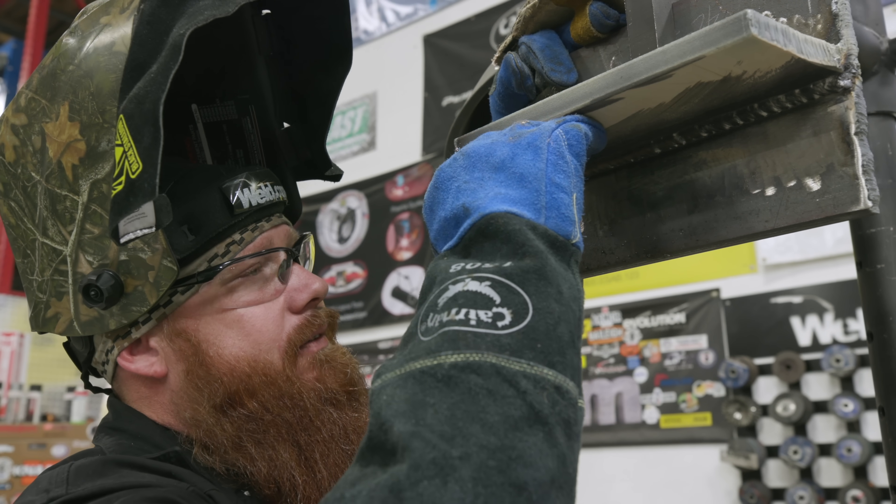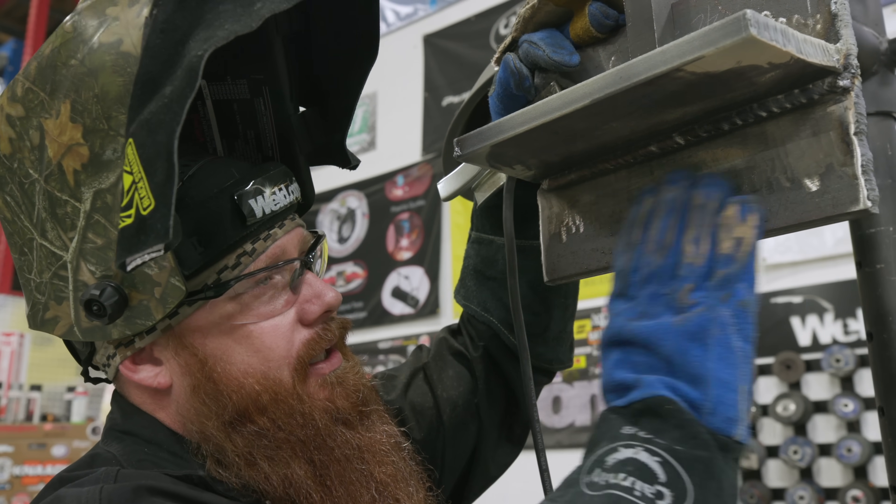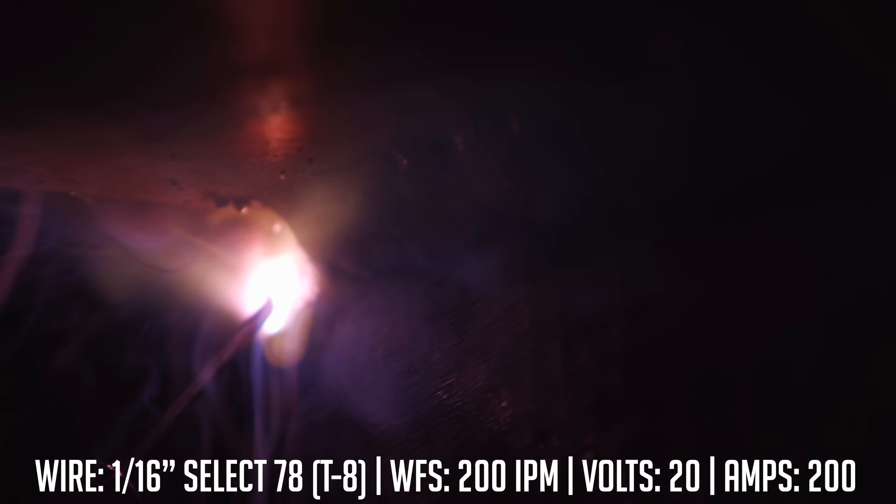For the most part I got exactly what I was looking for — 50% tie-in on the overhead horizontal leg and 50% on the vertical piece. I have a couple of spots I'm not too proud of, but luckily no slag inclusions. I have to run another pass anyway, so I'll cover those up. I'm going to slow down just a tad — I think I got a little overzealous. Next pass I'll run about three-quarters, and the last one about half, so you can see all three passes and how they overlap.